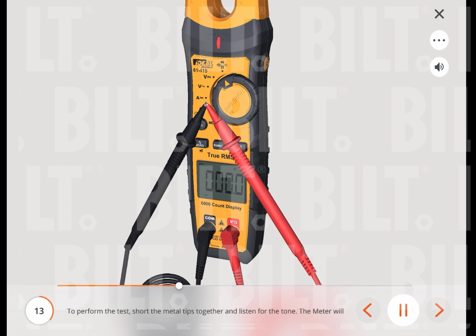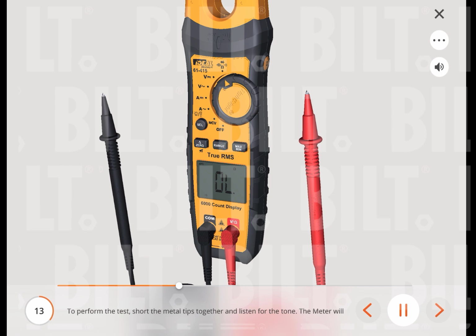To perform the test, short the metal tips together and listen for the tone. The meter will sense the level of resistance and beep if the resistance is less than 10 ohms, to confirm that continuity is present. Note: the meter defaults to continuity.